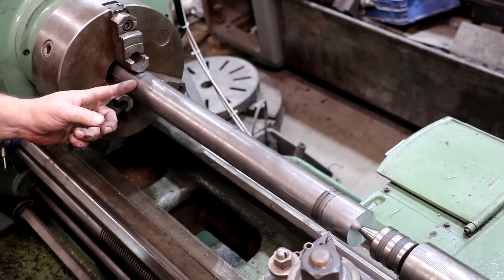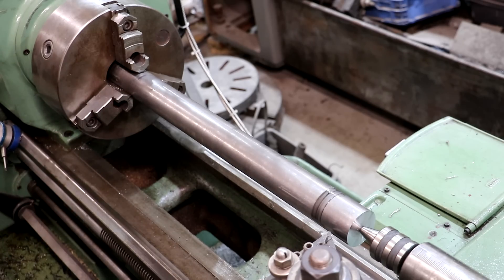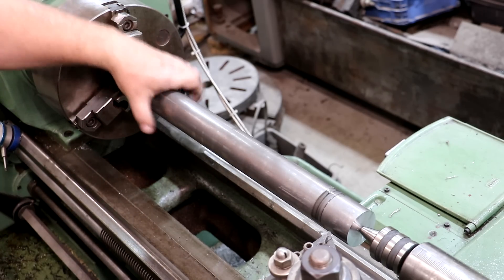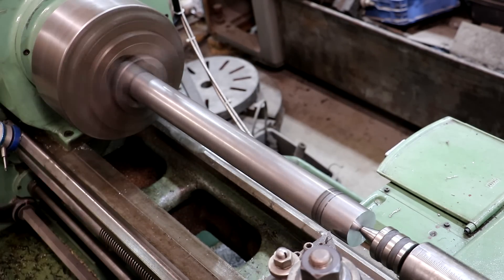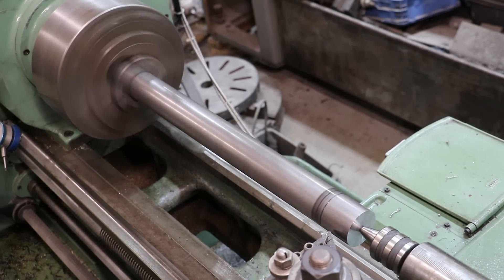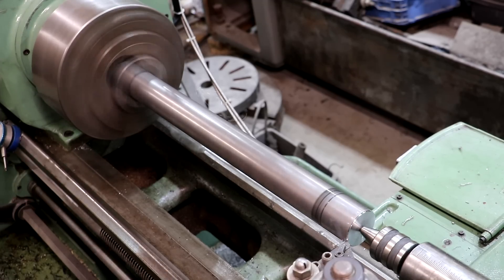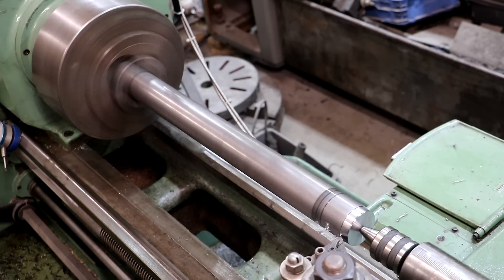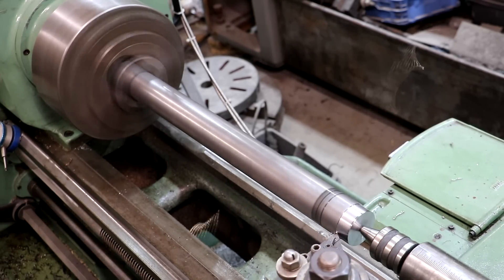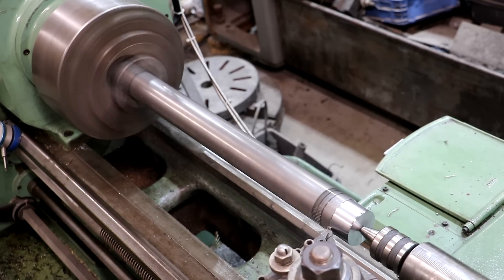The total screw needs to be 19 inches long — I've got a mark right here and I'll go a little bit past that. We're ready to start turning. We're going to get the large diameter of the end of the screw down to inch and three quarters first, then come in and cut the one-inch diameter after that. We're going to touch off here and take about a hundred thousandths off the diameter — fifty thousandths off each side. We're running at 720 RPM with a feed rate of 5.2 thousandths per revolution.